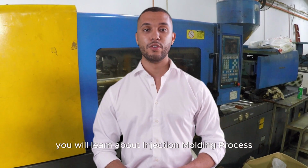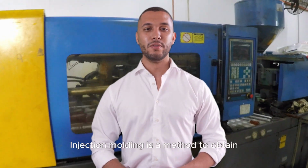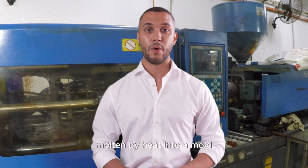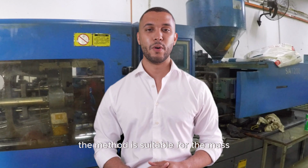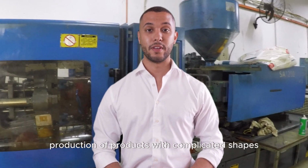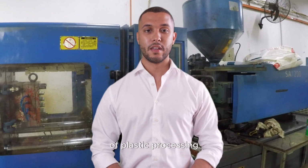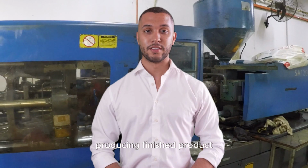Hi, in this video, you will learn about the injection molding process. Injection molding is a method to obtain molded products by injecting plastic materials molten by heat into a mold, and then cooling and solidifying them. The method is suitable for the mass production of products with complicated shapes, and takes a large part in the area of plastic processing. In this video, I will show the process step by step, until producing the finished product.